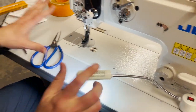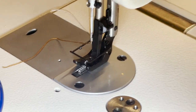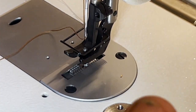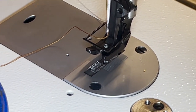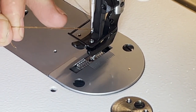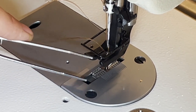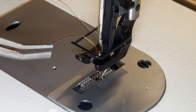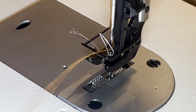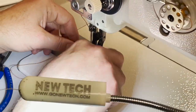I showed you how the feed dog and foot assembly mechanism works on the 1181 — only the foot is walking, the foot comes down and takes your fabric and goes. But with this 1541, not only the foot walks — the foot walks and then you have the needle and the feed dog going back and forth. So it's needle, feed dog, and foot together, which makes it much stronger. That's why people doing heavy-duty work want the 1541.